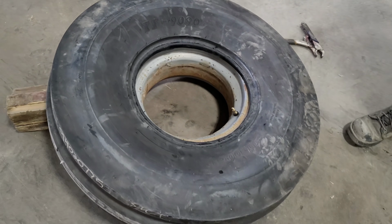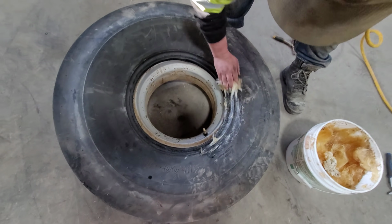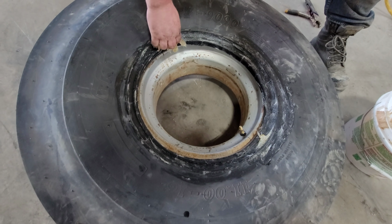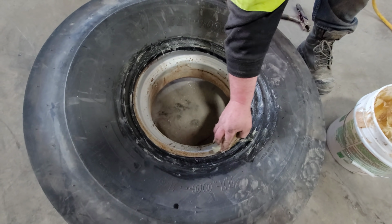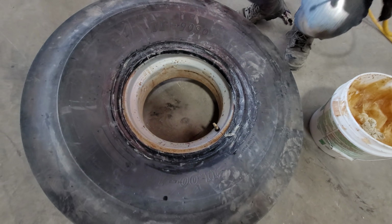So now our next step will be, there's our wetting band. It keeps the tube from popping back out. We'll need an air line and an air chuck. Goop. Put it around the bead. Nice and even. The goop is to help with the slide, so it doesn't get bound up, doesn't rip the bead, doesn't get damaged. Now I removed the core already.